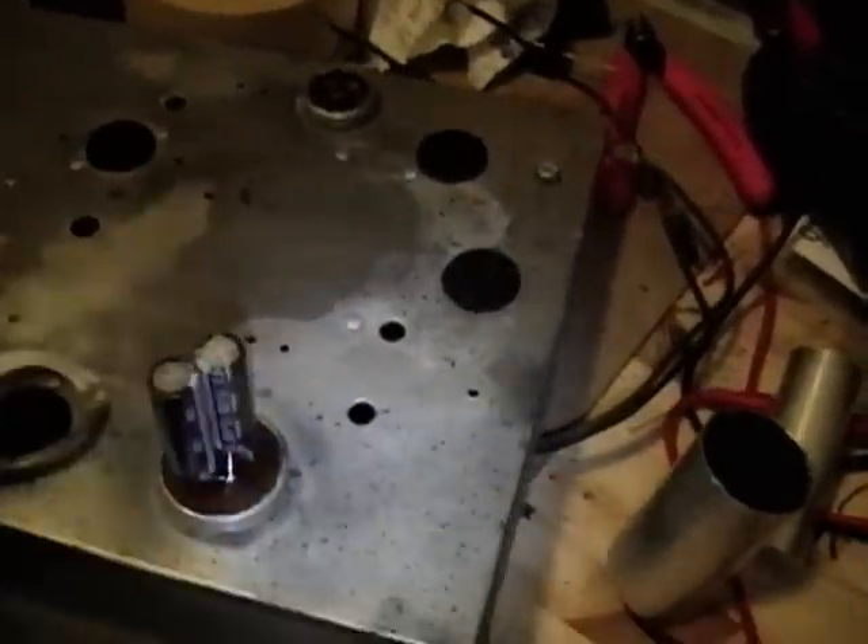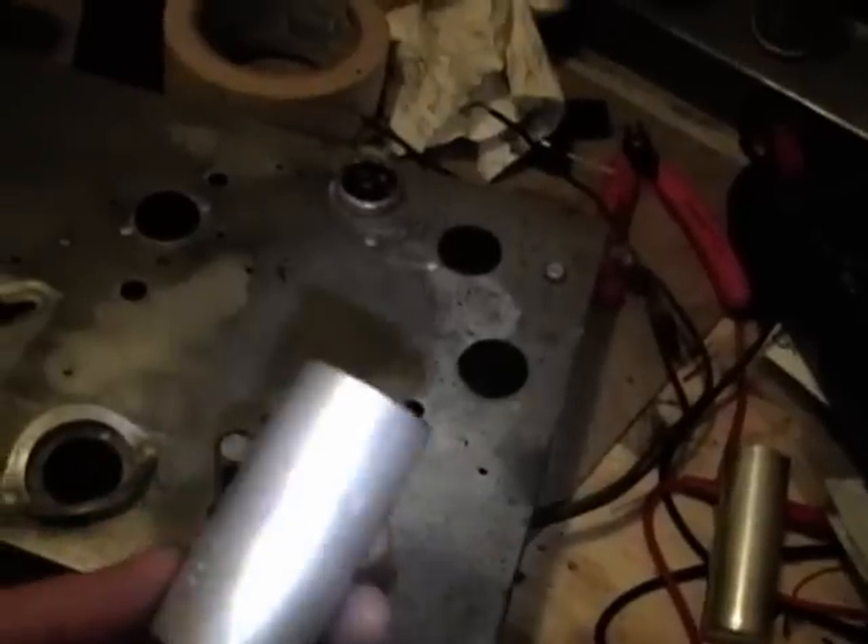I'll do the same for the other capacitor. That only leaves me to replace the bias resistor for the 6V6 audio output tube — hopefully that'll arrive tomorrow — and remount the power transformer. I've removed the transformers from the chassis because they were quite rusty and I'm working on removing the rust. I've already polished up the old aluminum cans and I'll try to match it up by rotating it to follow the uneven cuts I made with the Dremel tool to get it back in the right position.